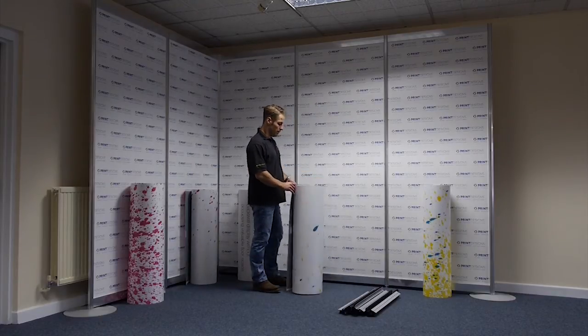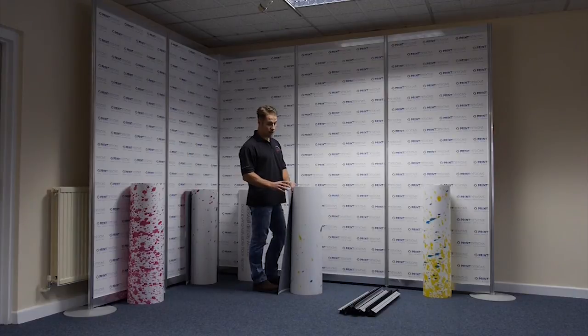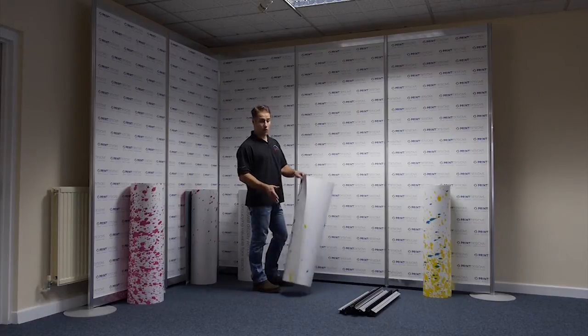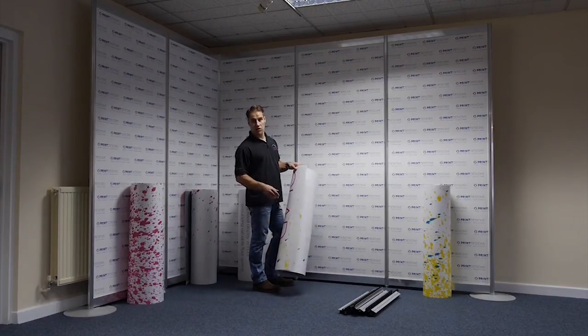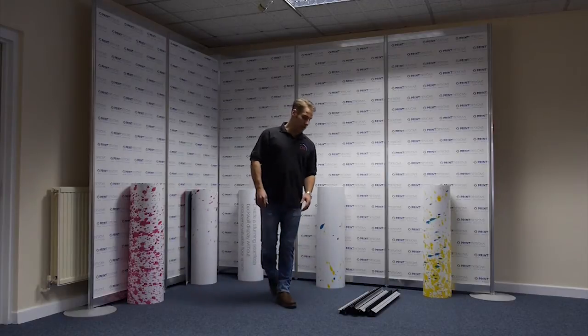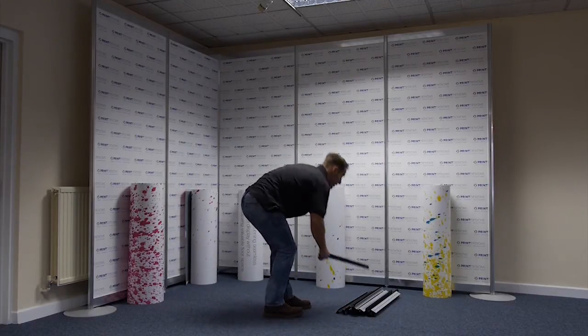It's worth noting that the manufacturers of shell-clad adapter clip also provide a backing material called magi-clad. That's a 4mm thick product which can be bonded onto the back of a rollable panel like this. And the benefit of using that material is it's going to give the panels greater rigidity. Unfortunately, that also adds to the cost significantly, which is why lots of customers who buy adapter clips from us have the standard rollable panels, such as this, just to keep costs affordable, really.